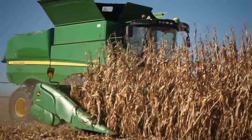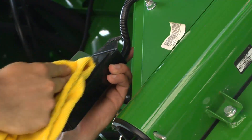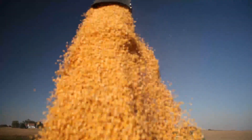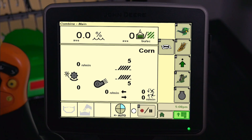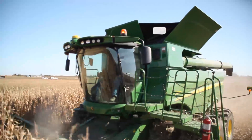Temperature calibration should be performed before the moisture correction and calibration. Make sure that the moisture sensor metal plates are clean at the beginning of each season. The plates can be cleaned with glass cleaner or water. Calibrate moisture for each grain type harvested. From the Combine home page, press H. Then press D for Moisture Setup. Checkmark the box labeled Moisture Correction. Next, make sure the numerical box reads 0.0. If it does not, highlight the box and change the number. You may return to the Combine home page.